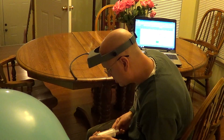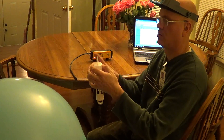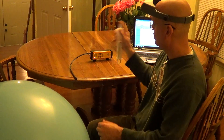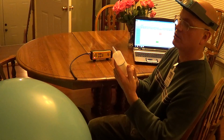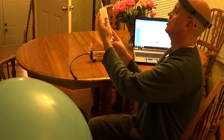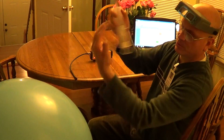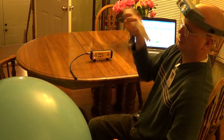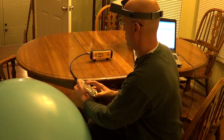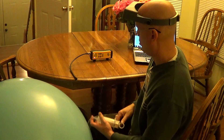We're going to do 10 cc, go to one part per million. Back to auto mode because the light is on. Now we're going to go down to 25 cc and fill in with air. Notice I blow out right here, then fill in with air — I don't want to be sucking back in refrigerant. Here's 250 parts per billion, and you can see you get three bars at 250 parts per billion.